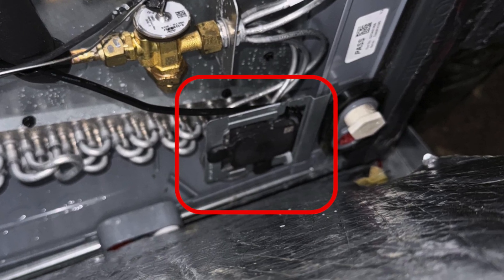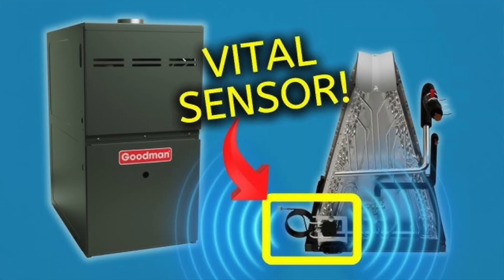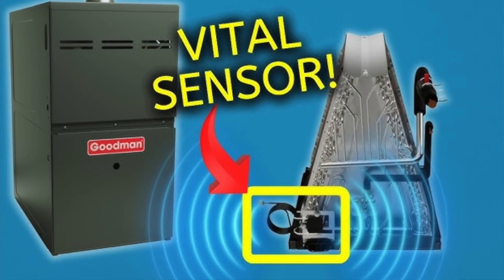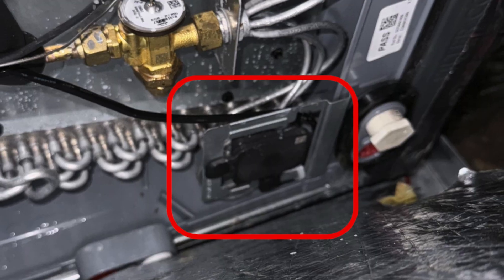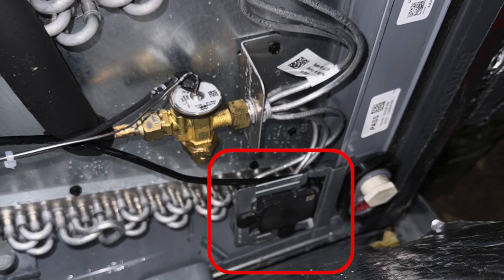Because we have that sensor, your system is looking for it. If you buy a new furnace that is A2L compatible, it will ship A2L ready and it's going to be looking for that sensor right away. One of the calls I would get from contractors from time to time was, 'Josh, I don't have a sensor. I just installed this entire system and I don't have a sensor — there isn't one with my brand new R32 coil.' I would tell them there might be one — take this cover off. And sure enough, every single time they would then find the sensor.